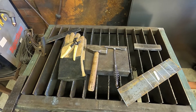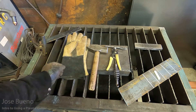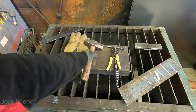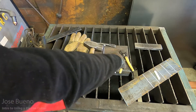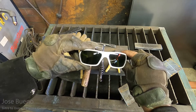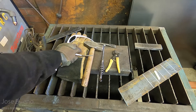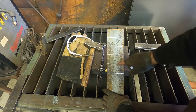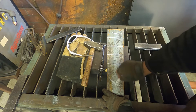Let's take a look at some of the things we're going to need. First things first — gloves. You want to protect your hands; we're going to be dealing with hot metal. You can use either regular work gloves or thick welding gloves. You're going to need a hammer in case your pieces stick together, and a chipping hammer to chip off the dross that forms on the underside of the cut. You'll also need some pliers or vice grips to handle the material when you're done. As far as eye protection goes, you can use the same shade lens we use for oxy-fuel welding.